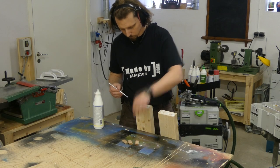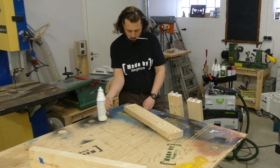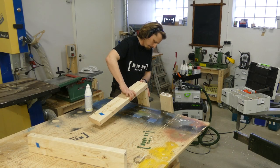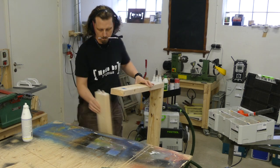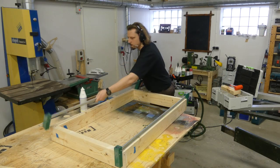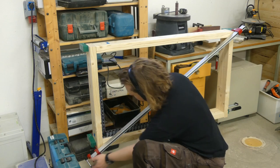The glue I'm using is an ordinary wood glue, and I just make sure to get complete glue coverage in all the mortises as well as the loose tenons. The assembly went smoothly and the dominos helped lining everything up. It was just a matter of adding some clamps and checking for square. In my case I had to make some smaller adjustments using a clamp diagonally.